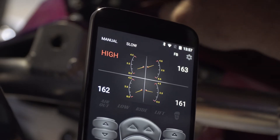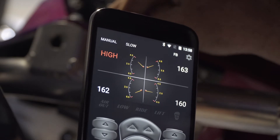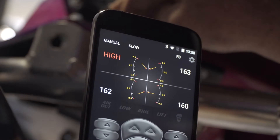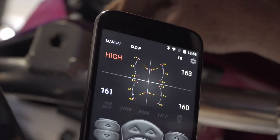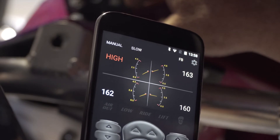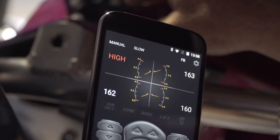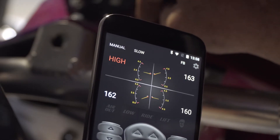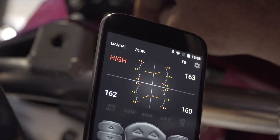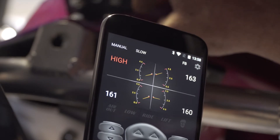As we move the arm you can see that the sensor itself is moving. When you set it up you don't want to be beyond the end of the marker where it's red — you want it to be just under so it lines up, and on the other end you want your travel to be close there as well. You can use the position on the suspension or the different holes on the arm to achieve this. Just remember the center point of your travel at 50% is in the middle and you need to be at least 25% in either direction for it to calibrate.